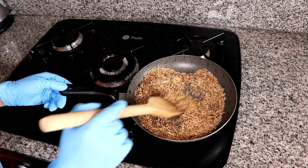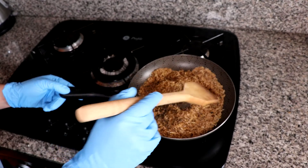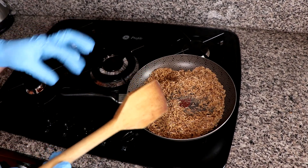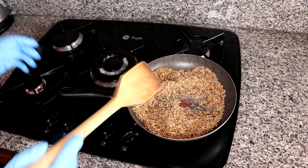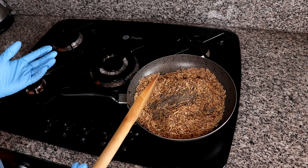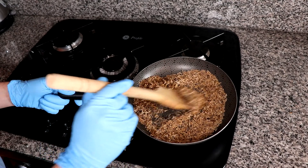Basically the idea is to heat it up and just monitor it — heat it for a while until it's all dry. And if you want to be more precise about it, you can dry it, then weigh it, then dry it again and ensure that the weight doesn't change much. If it changes, then you either still have water left or you're burning whatever media you're using — two things that you want to avoid.